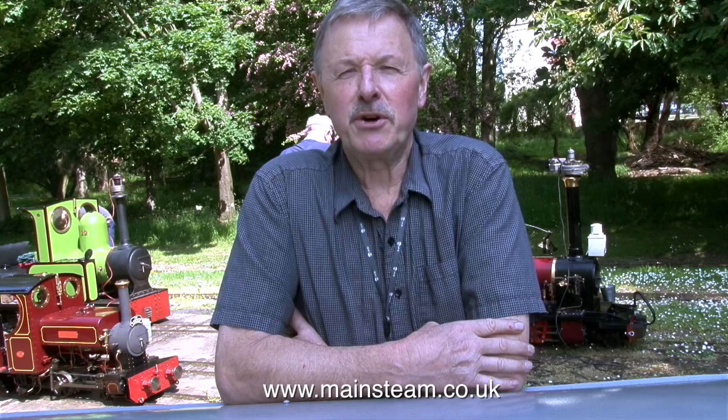Good morning Keith. What we're going to do today is go through all the stages of preparing a steam engine from cold. That will involve sweeping the tubes, cleaning the smoke box, cleaning the ash pan, and lighting the fire. We shall raise steam and then test both the injectors and the safety valves, and if we're happy with all of that then the engine is good to go.